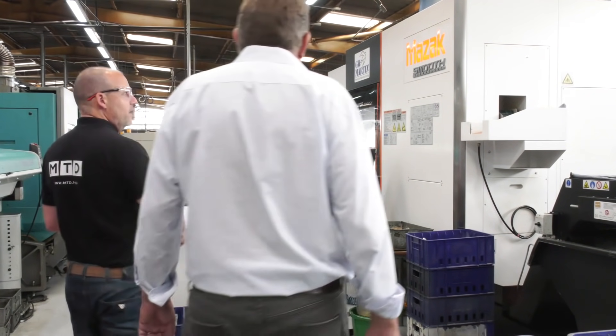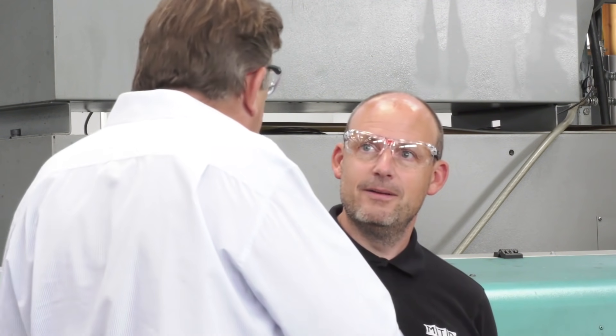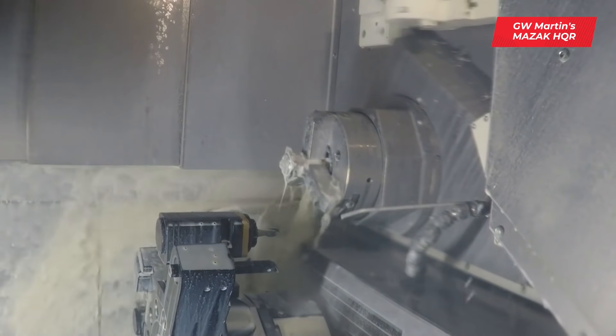What's important about a machine like this is how it's built. Richard mentioned it was quite a bit bigger than some other machines, yet far sturdier — that's quite an integral part, certainly with deep hole drilling and lots of metal removal. The stability comes from the turrets themselves, and both turrets have Y-axis travel as well. It's a very rigid, true slant bed machine, running Hainbuch collet chucks on head one and head two for ease of transfer. And there are no restrictions — you can do the same on the back as on the front.